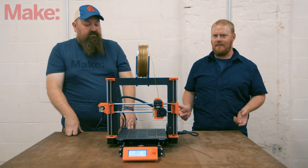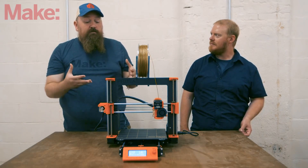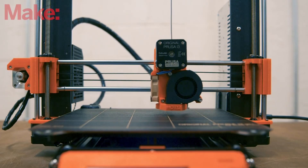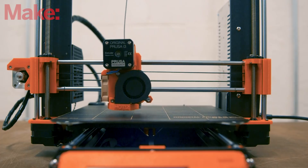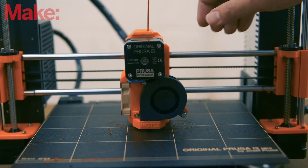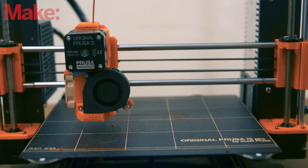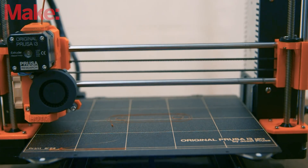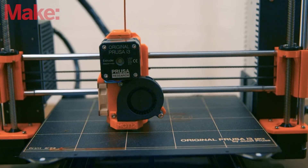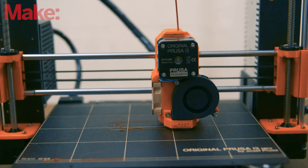What's unusual for most 3D printers is this machine actually doesn't have any end stops in it. The new Trinamic stepper drivers mean they don't need end stops — the drivers themselves are able to detect when the machine runs into something and use that as the end stop. They're also able to use that to detect while printing if the machine has collided with anything and pause the print. This ensures that if you have any curling, or if your cat walks onto your printer and accidentally knocks into it — which has happened — it pauses the machine for you.